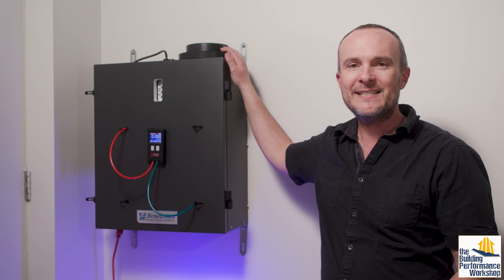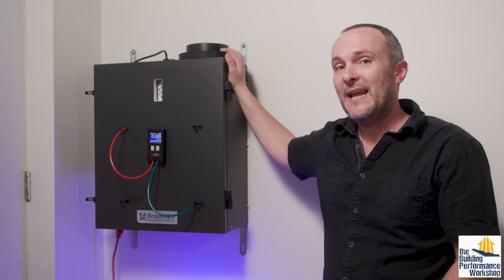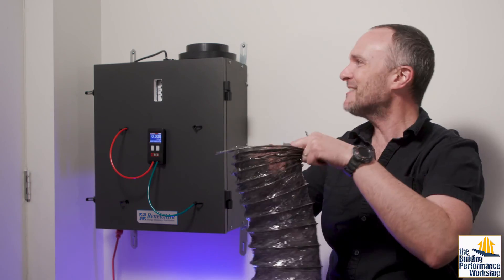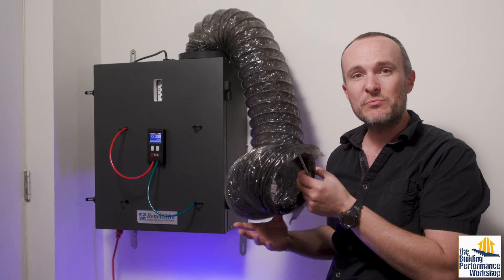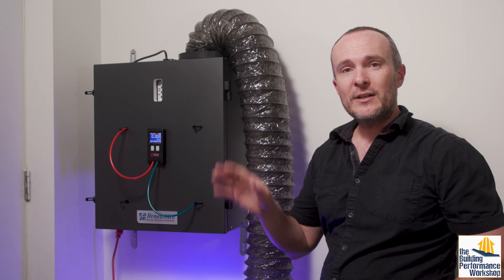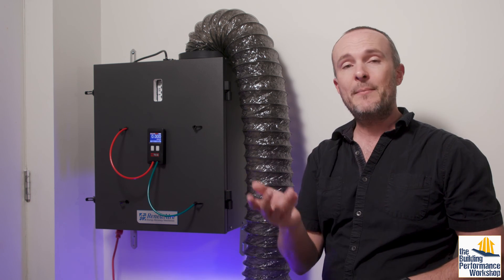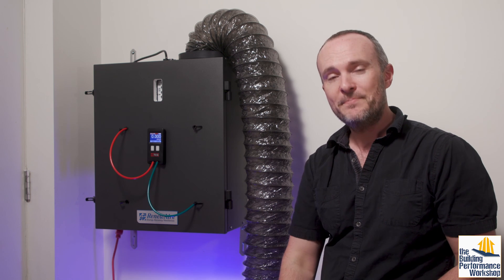Remember that this piece of equipment right now was just tested with no ducts on it, which is very nice. They do that at the lab before this piece of equipment left the Renew Air factory, just to make sure it worked. But of course, once we add ductwork, it is going to impact the airflows and the pressures depending on how smooth, straight, long, and where the duct goes. So remember to test in the field — don't just rely on the testing from the factory. I hope this has proved useful for you. Please post questions and comments on other brands of ERVs you'd like to see on this channel — I address those personally. Please do like and subscribe.